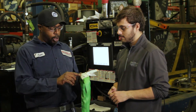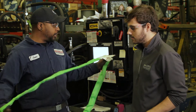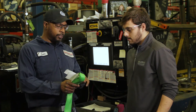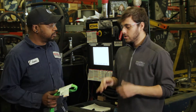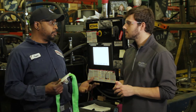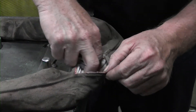We took it to two times the vertical working load, which is 5,300 times two. What that does is make sure it's working properly and that it was made right. The customer normally only goes by these numbers just to keep them safe. So this is safe to use in the field? Yes, this is perfectly safe to go to the customer. If something went wrong during the proof test and it wasn't safe, it would fail, and then our inspector Brian Guerra would look it over and find out why it failed.